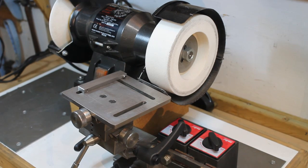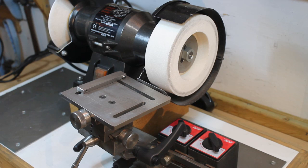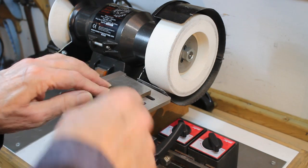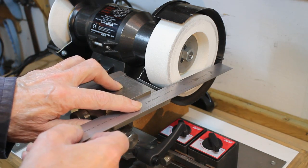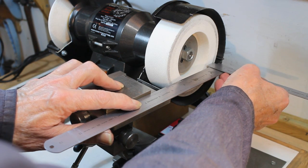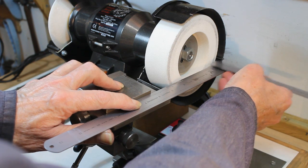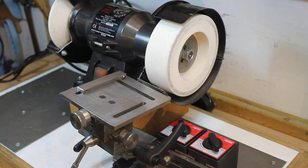The next stage is to set the fence round by about 2 degrees so that grinding is done on the corner of the wheel. This being the standard practice for most tool sharpening. I am testing the angle by measuring the difference in the space at each edge of the wheel, anywhere between 3 and 5 mm over 100 mm being more than accurate enough — this on the rear edge.